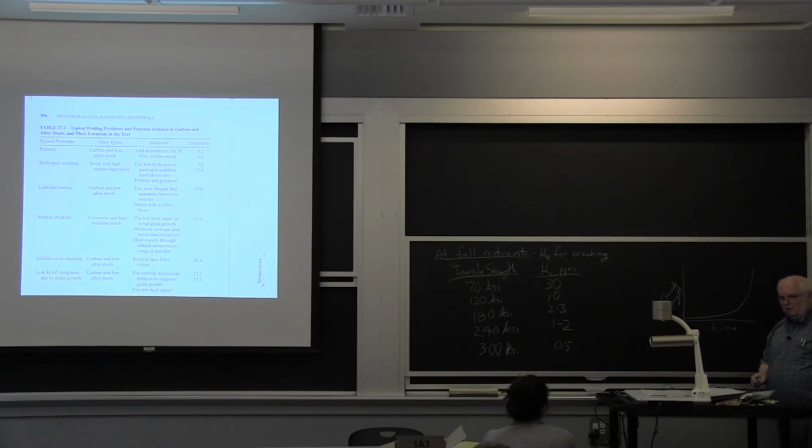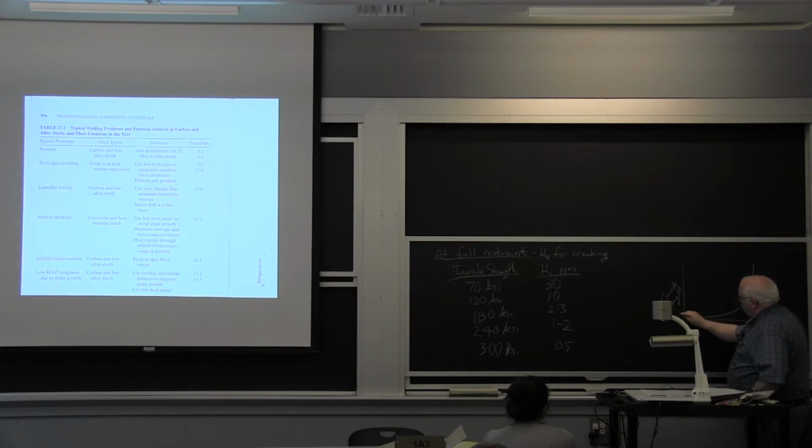That's called the Paris Law, and Paul Paris is a retired professor at Ohio State University, and he is one of the most arrogant people you'll ever meet. He's not the most arrogant I've ever met, but he's in the top 5. Okay. Other than that, he's a nice guy. So the fatigue crack rule is sort of, the fatigue crack grows 10% of its length in the first 90% of its life.